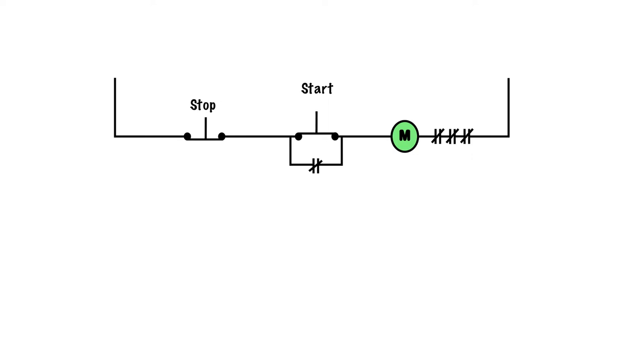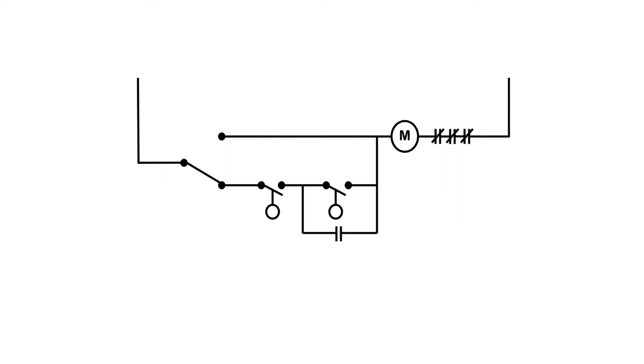Now I'm going to show you one more example of a low voltage release circuit, because it can commonly be thought of as a low voltage protection circuit — but that would be a mistake. This is a sump circuit — you can watch the video on sump circuits to see exactly how they work. What trips people up here is you see these holding contacts, and often people will assume this is a low voltage protection circuit. It is not — it is low voltage release.